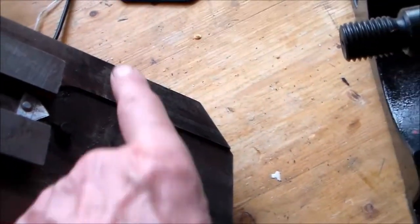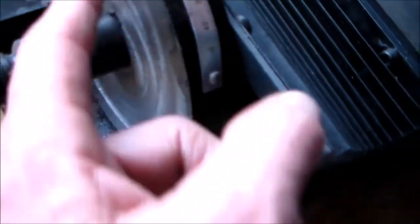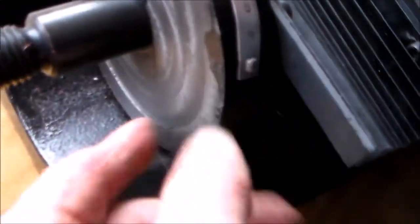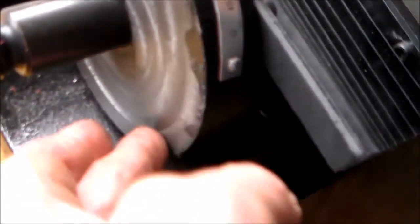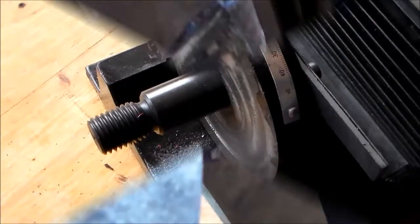First step is mounting the column — or fuselage as they call it — onto the base. It's reasonably well machined but needs cleaning up. One of the things to improve it is to actually scrape that surface to get a better finish. I might assemble it first and see how accurately it turns out before bothering with that. Underneath the base there's some paint resin or something squeezed up around the side that's not easy to remove, but we're going to have to take it off. Just chipping away at all that muck underneath it — an extra job I didn't expect to do.